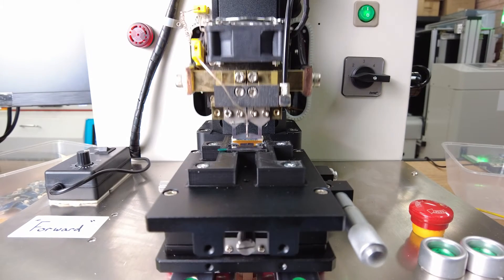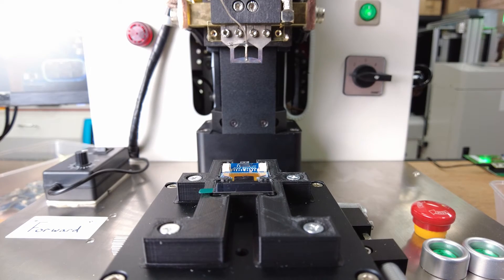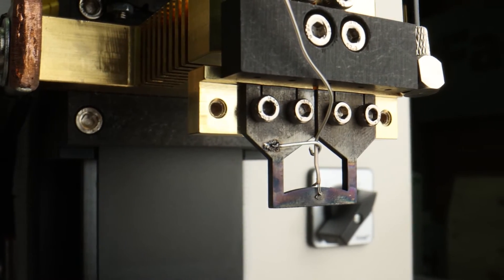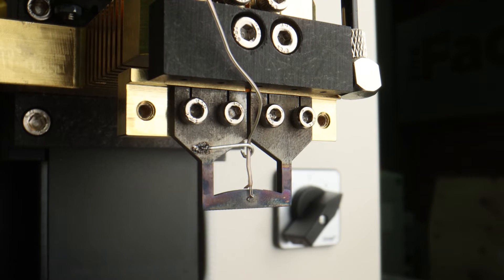This is a little different to a conventional soldering iron because the current is actually passing through the soldering tip. For a handheld iron there's a heating element in the body and heat is conducted into a replaceable tip. Here the replaceable tip is also the heating element, made out of some high-grade material — I think there's tungsten involved — so that it can withstand a lot of cycles. You can see a thermocouple is bonded directly to the tip so you have a good temperature reading right at the joint.